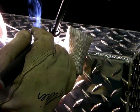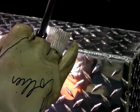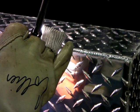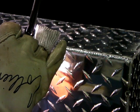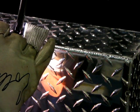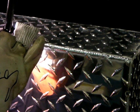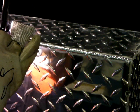So what we learn here: it takes about 125 amps to equal 90 amps if you're using 100% argon versus 80% helium and 20% argon. And there's a difference in the way the puddle looks — it's a cleaner puddle, a clearer puddle, not milky. It's fluid. It's a hotter arc. Energy is added to the arc with helium. You get more voltage even with the same amperage, and it's just going to help you, especially on those thicker jobs.